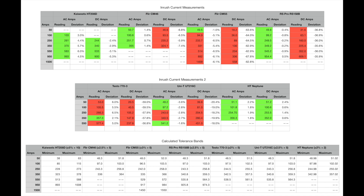The clamp adapter I have for the Neptune can only go up to 400 amps, so we're missing a couple of readings. I may look for a current clamp adapter with AC/DC capability up to 1000 amps to test further. Overall, it looks like you can read DC inrush amps with some of these clamp meters, but it tends to be specific to individual clamp types with not much consistency across them — so you really need to test your own unit to know what's going on.